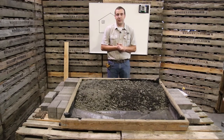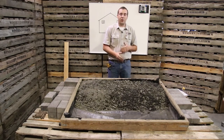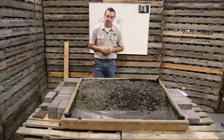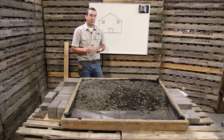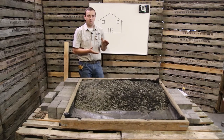Before I get into the instructions on how to install paving stones, I always like to talk about the benefits of concrete paving stones versus wet poured concrete or asphalt. Our paving stones are manufactured with a common specification of about 8,000 PSI or above, while wet poured concrete is typically 4,000 PSI. So our paving stones have over twice the density, therefore they will last a lot longer and will not deteriorate as fast. Also, the main function of a paving stone system is to be flexible — there's excavation, a gravel base, compaction, and a bedding layer. All that combined makes for a very good, long-lasting pavement system.